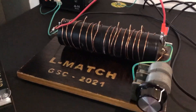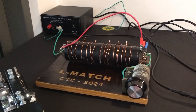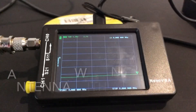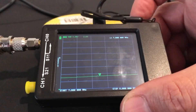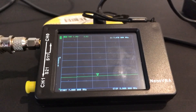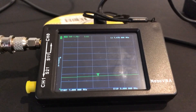Now we just get it on the air and see how it performs. Our first test will probably be on 3.5 MHz with a small homemade receiver and transmitter. Then when I get the QCX Mini kit done, I'll be doing 7 MHz as well. Let's see what it looks like on 7 MHz — this is 7 to 8 megahertz, and if you sweep across it's a pretty flat 2.7 to 1. I did try adjusting the length of the antenna but it didn't seem to make a huge amount of difference — there's so much metal around. This would probably be the frequency where you'd expect the lowest SWR, and certainly that seemed to be the lowest point in resonance on the actual sweep when we did 1 MHz to 30 MHz. Jump into my playlist and look at the four videos I did on the actual antenna, its installation, and thoughts around it.